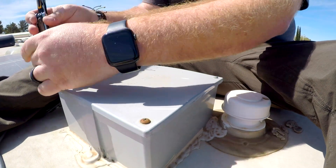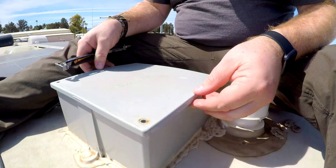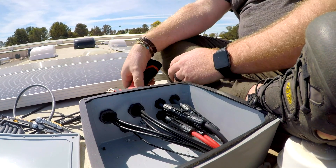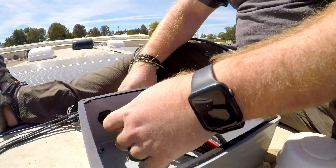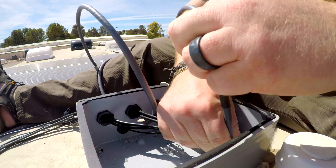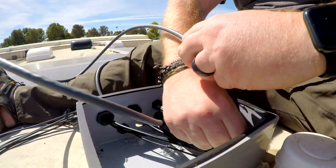Then we're going to be running the cable. I'm actually running the cable through an existing solar box — a cable drop I've got. It's a junction box from Home Depot, not that expensive. I ran a two-inch PVC pipe through that hole. There's a video on this entire install from Eric which I'll link above. I'm just running this cable through — I didn't have a cable grommet big enough at the time, so I'll show you at the end what I did there. Running that cable through the existing opening has been a really nice system for adding new antennas or testing, and definitely something I'd recommend.